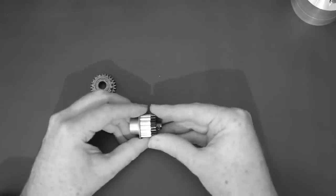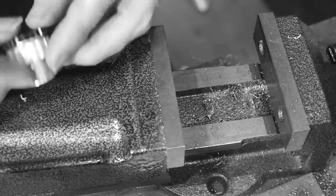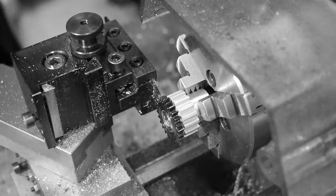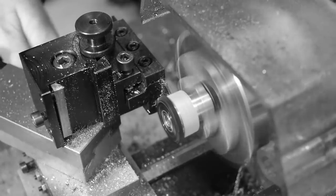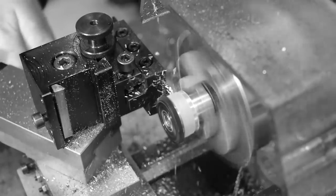0.6mm is not common in modern thread standards, and my lathe doesn't include a change gear for this pitch, so a few months ago I made a new change gear to allow me to cut threads with this pitch. The obvious solution was to make a tap myself and make a toolmaking video for Emma's Spareroom Machineshop competition at the same time.